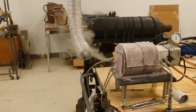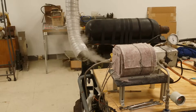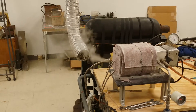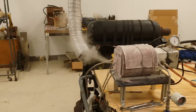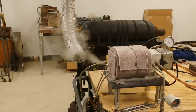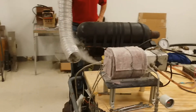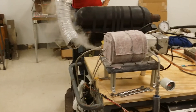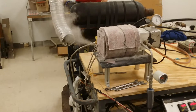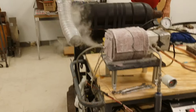I envision — and we'll see this afterwards when we go upstairs — the 3D design has banks of eight of these injectors. This is using a hydraulic injector, but in practice we would use a piezoelectric injector because obviously you don't want to deal with hydraulic fluid. You'd need a very high-pressure pump, but that's all electronically controlled. You have a manifold with pressurized water at 20,000 to 25,000 PSI, and then you electronically open and close the injectors.